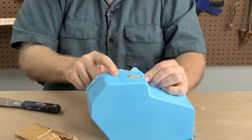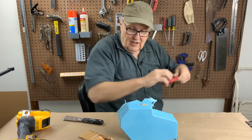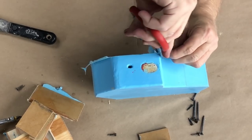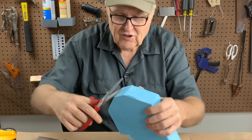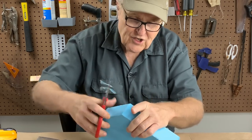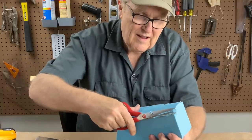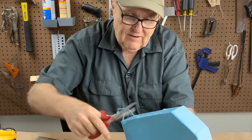There's our pour funnel, there's our vent. Let's trim a little just for fun — let's clean this little mold up, make it a tiny bit prettier. This is pure cosmetics; it doesn't hurt, but I don't like the flash on stuff. I'm anti-flash, I admit it. And I find that scissors are just about the fastest way to remove the flash.